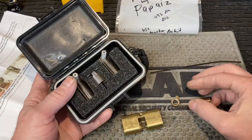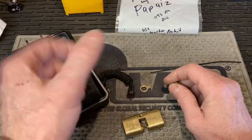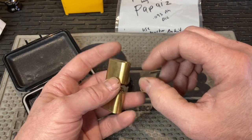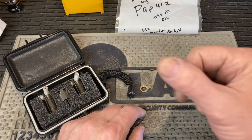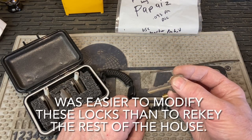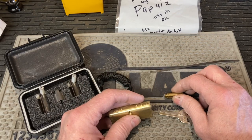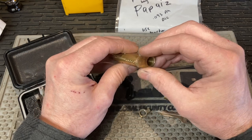I had to hurry and rush and get those profile cylinders put back together. I ran into the problem where I put the big spring all the way into the body up against the thumb turners on the back side — the ejector pin. It's like a three-piece combo — brass with steel, spring-loaded — that went inside that. Well there was that button that you could tell by its orientation would push up against that piece. That needed to be extended because the Quickset key did not go far enough into that keyway. It wasn't a Wiser keyway — it was 150 thousandths between the different cuts, but from the shoulder stop to the first cut was about 200 thousandths, and it didn't match anything that I had. I looked in my depth and space book and never did find it. So I just made a spacer that fit into it and it worked perfect.